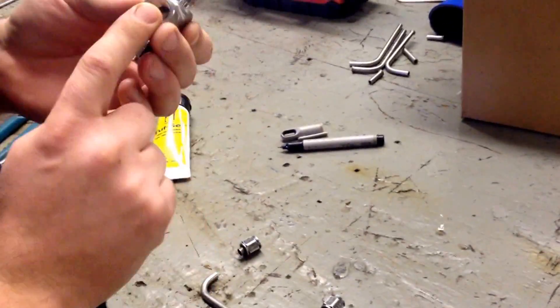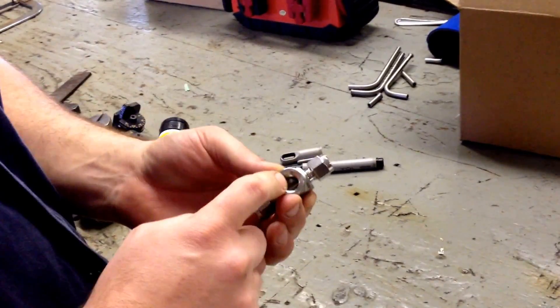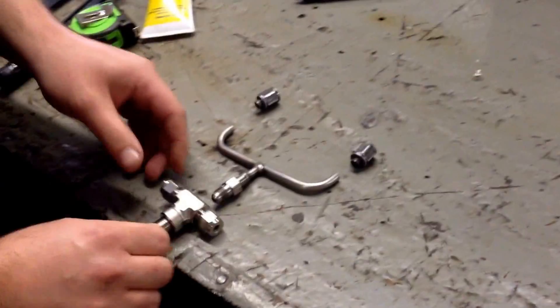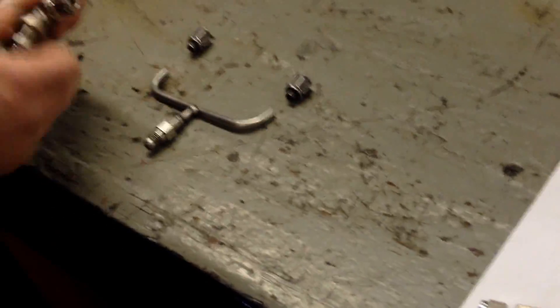Alright, so let's get started here. I've got some new fittings - quarter compression by quarter compression, male connector to female pipe. This is going to take up that part there. Then we've got some new tubing nuts that we're going to put here to make the bend nice and leak proof. The first thing we're going to do is cut some stainless steel tubing. I've got a 20 foot stick here that we're going to cut up, starting down from this end.